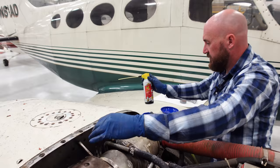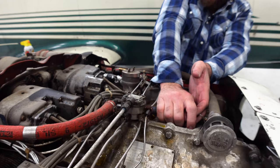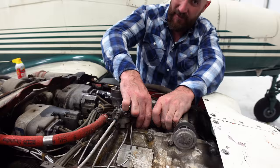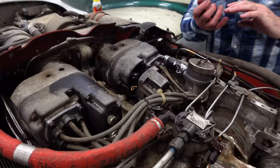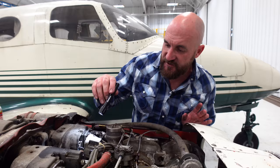We'll let that sit. We're going to pop these caps off — as far as I know, the points should be down under here and we can see what they look like. It looks like we got it loose. We'll take a look in there with a flashlight. Wow, so the points in there are actually really clean — everything in there is really clean. I don't see even one little bit of corrosion, which is really surprising.